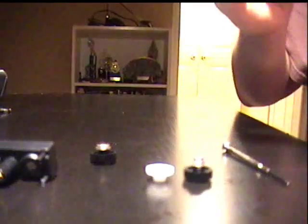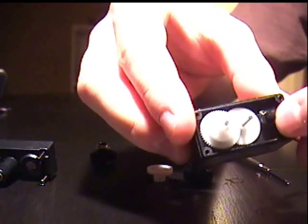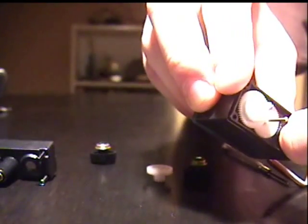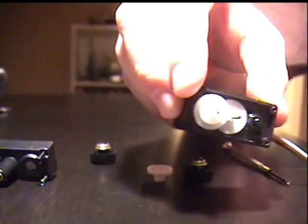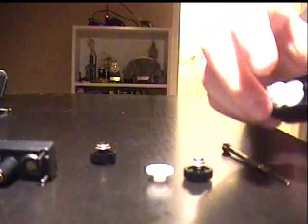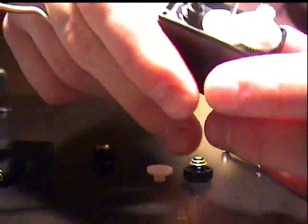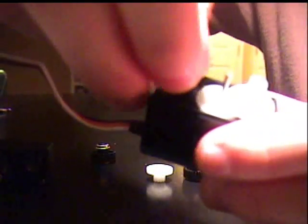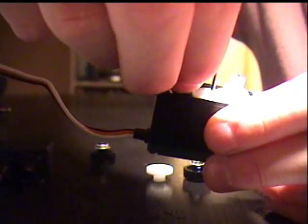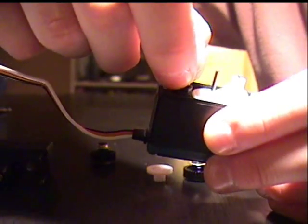Now, we're not ready to put the second gear in yet. We have to set that because it's a potentiometer, and what that'll do is it'll make the servo rotate degrees, and we need to set that to zero so it doesn't rotate anymore. So to do that, we're going to go over here — as you can see, the motor is getting out of control. What you're going to want to do is twist this little nub right here until the motor stops spinning.